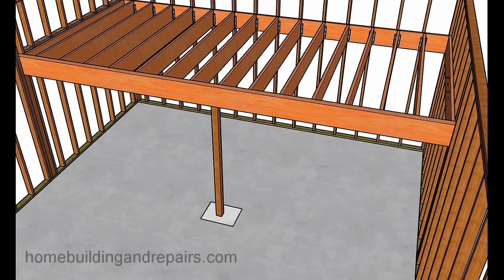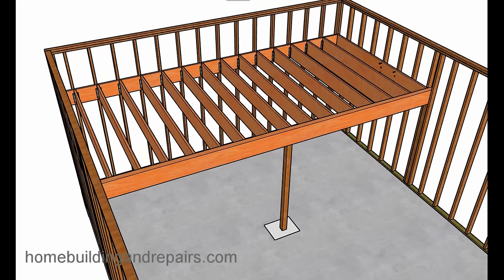Let's go ahead and take a look at another suggestion. Let's say you think you're going to need a 6 by 12 or a 6 by 14 — well, you might be able to use a 4 by 12 or a 4 by 14 if you put a post in the center. This would cut the load in half — the structural load from the floor. Also, if you're going to build a wall across here, you could use the wall to help support it. The wall would come off the end of the post, and you could basically put the post inside of the wall.